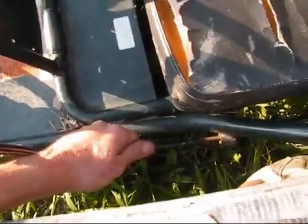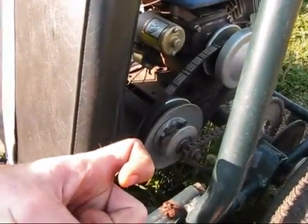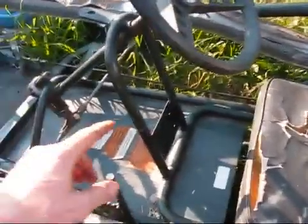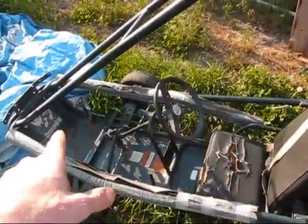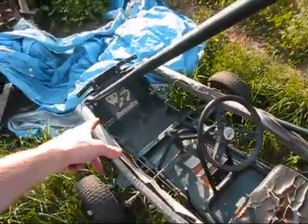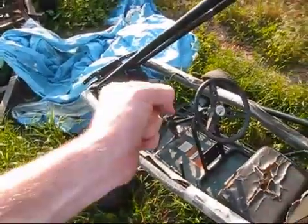What you might want to do is, if you've got that idler pulley that pushes against the belt, you could run a solid bar on there that'll pull it. You might want to make it a little longer so you've got more leverage, but solid bar pulling on it, and then in the front you could have some type of little handle thing that's going to engage it, push against it, pull it back, and it pushes the pulley right into the belt. Because you really don't want a foot pedal operating that thing. You don't want that, because then you'll have three pedals. You have your brake, your gas, and your clutch. Pretty much is what it's going to be, is a clutch pedal, and you don't want that. So what you'll want is something to do with your hand.